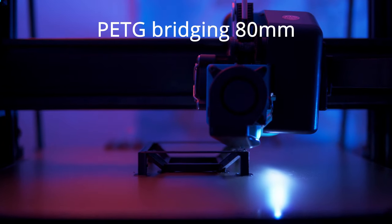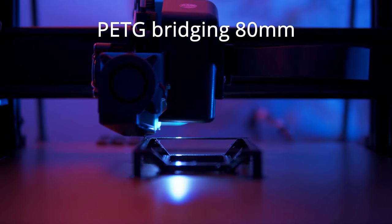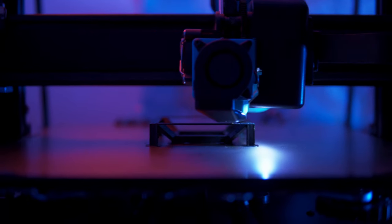To find the right temperature, invest 10 grams of filament and a little over an hour to print a temperature tower. On Thingiverse you can find many of them — I'll leave some links in the description. When you combine proper E-step values, which depend on the motor gear setup, and extrusion temperatures, which depend on the nozzle, the cooling, and the heat block, with a properly leveled bed, you will have a bulletproof setup for flawless 3D printing.